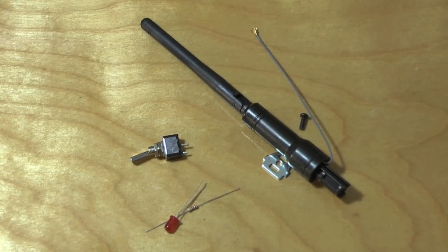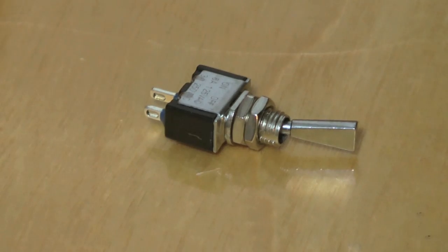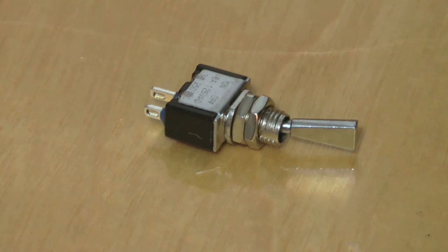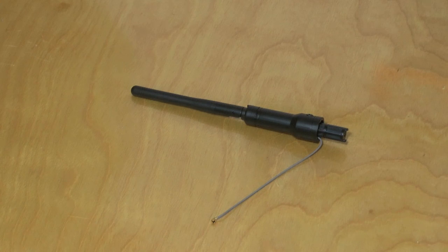Now that you know the state of BusyBTV, let's get into our episode and repair my DX6i radio. Here are the parts you're going to need: the switch, the antenna, and the LED. The switch is a single-pole, single-throw switch, or SPST, mini-toggle with a chisel-tip head. This is a basic red LED with a 220-ohm resistor. All these things can be found at Radio Shack and are a little bit under $5. The antenna is from HorizonHobby.com and is about $12. All the links for all these parts are available in the description.